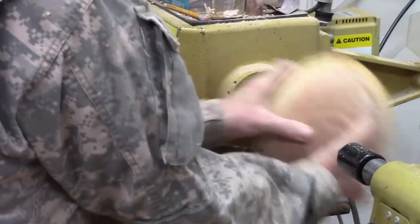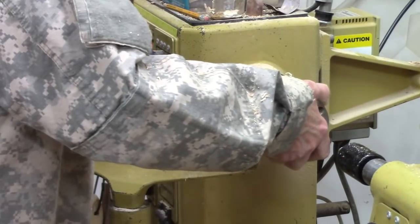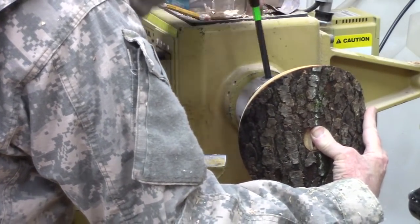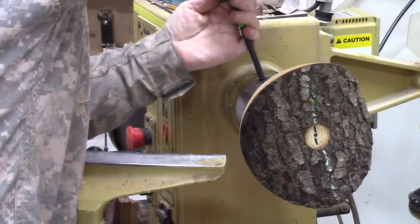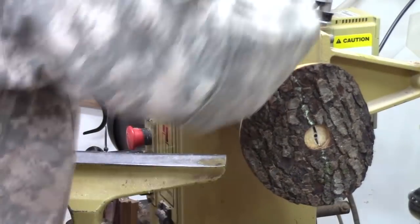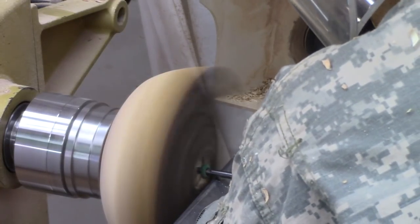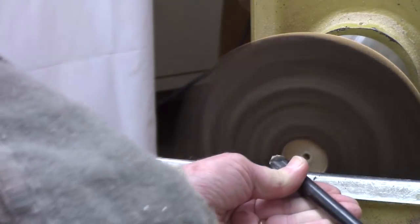I have a nice clean tenon now, so I'm going to go ahead and reverse it. I take off the drive center and install the chuck. I mount the bowl, pressing in from the center to make sure I get it nice and even all the way around as I tighten it. Because this is green wood I'm going to go around the chuck and tighten it at least once on both sides. I need to follow up with that periodically while I'm turning. Here I'm using a drill — I set the depth using a wooden handle with a small grommet in lieu of tape.